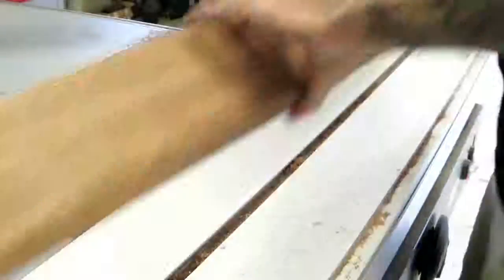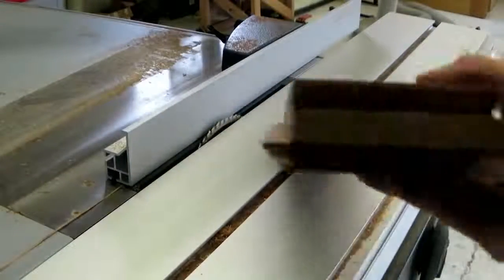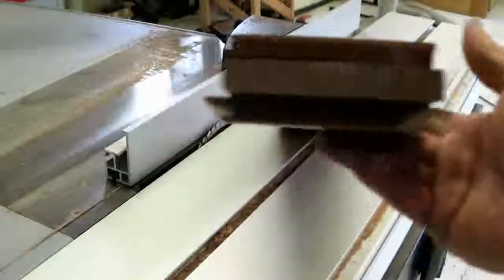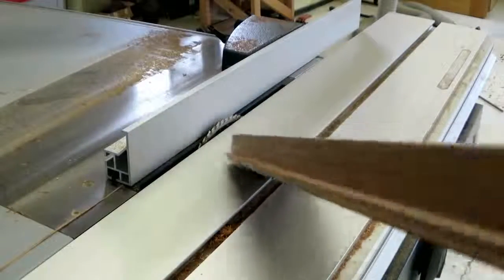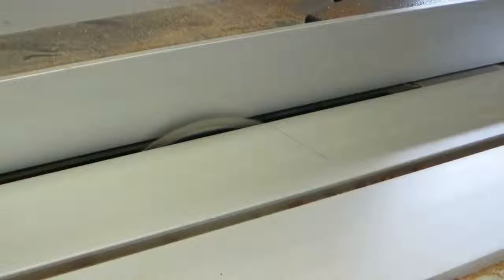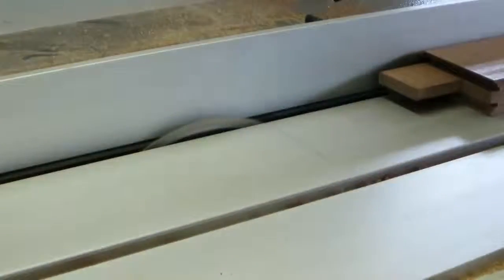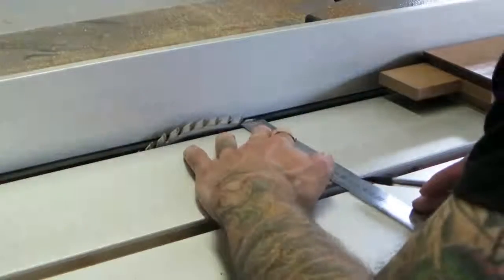The top section of the door has glass panels, so I needed to rip off some pieces of the moulding that were integral to the rail and stiles so I could get the glass in. That was a little bit of playing around — I needed to work out the start and stop position of my blade on the new saw so I could do some stop cuts — but anyway it worked out pretty easily.